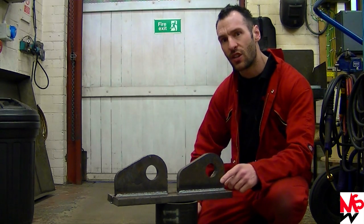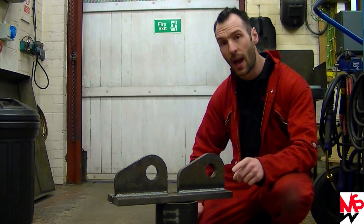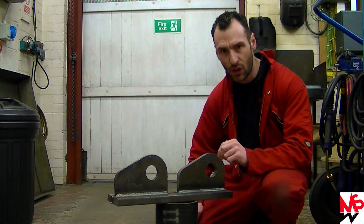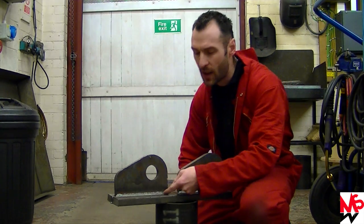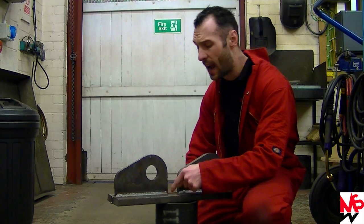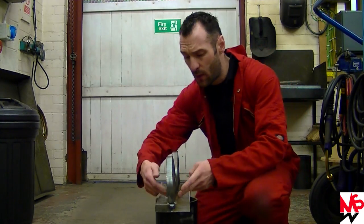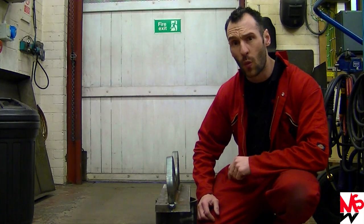But the engineers at Hypertherm have come up with a way of bending the rules, and by bending the arc with their brand new FLUSHCUT consumables, we can get as close as 2.5 mil to this base plate, and cut this big 25 mil lug off here with a big weld down both sides off in one pass.